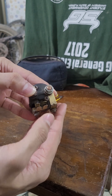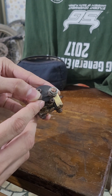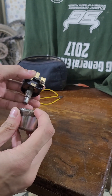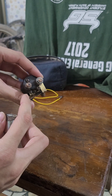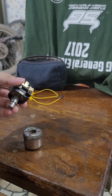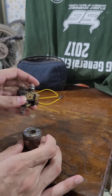If you're trying to do the same thing, pay close attention to any pins that have been soldered. I should have ideally desoldered these in order to not break the solenoid while taking it apart. These two wires go up through these holes and get soldered over here, so they have to be desoldered before you can separate the two halves. Don't make my mistake.